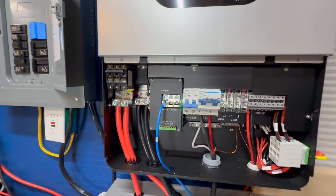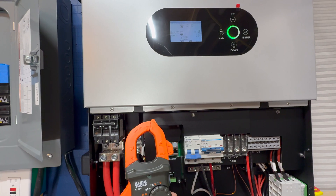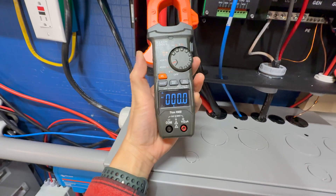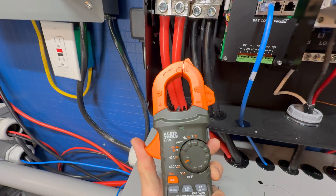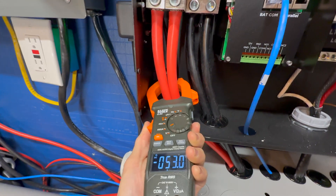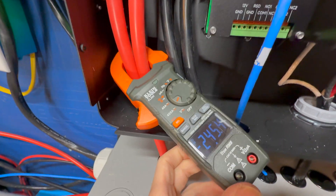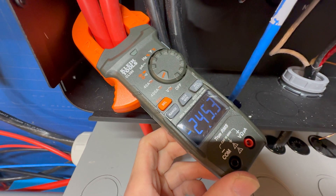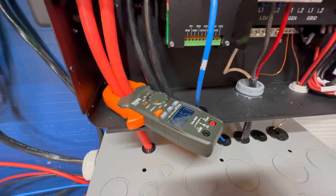It's powering this video too, which is really nice. So I have an amp meter here — it was on AC, let me switch it to DC. I initially had a problem getting the wires around this because the jaw clamp was too small and wouldn't fit. You have to turn it a little bit to get it closed. According to this, we are drawing close to 245 to 246 amps from the batteries.